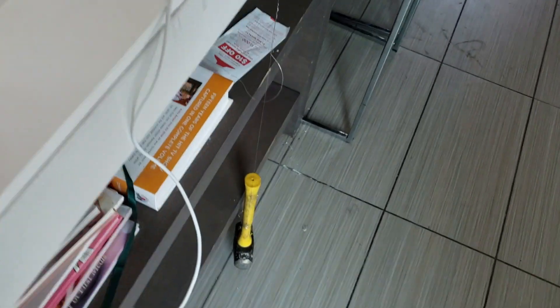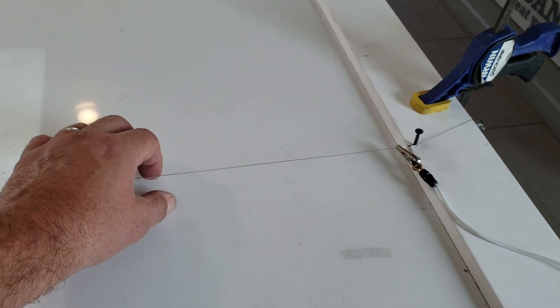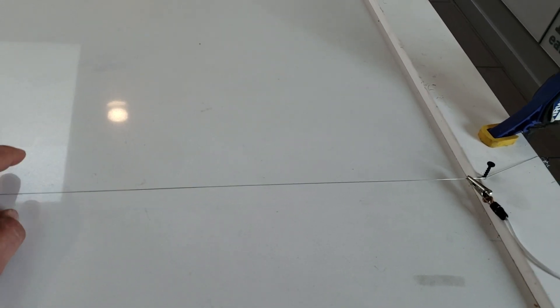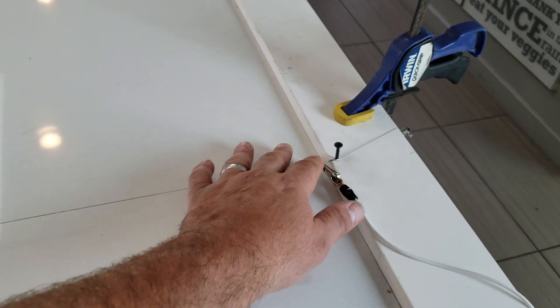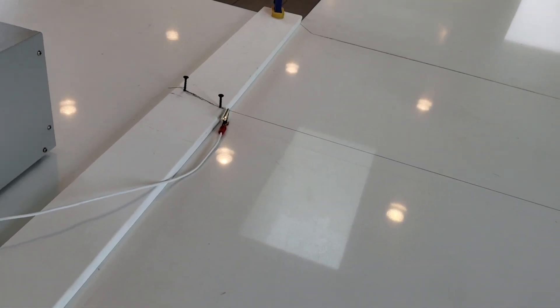It's just clamped to the table, and down here — one of the secrets of this — I've got a mini sledgehammer tied to the wire. That's putting tension on it. You can use springs or whatever, because when this wire heats up it's going to expand. If you just pull it real tight and then heat it up it's going to sag. So you want to have some means of adding tension. I used a hammer — a dead weight, gravity. You can use a spring, whatever you like.